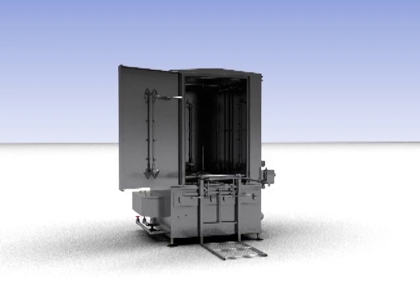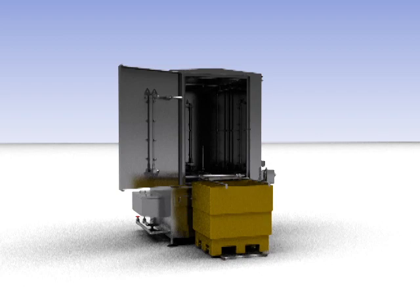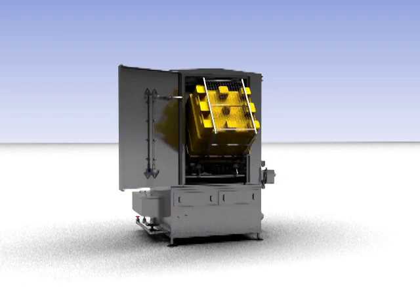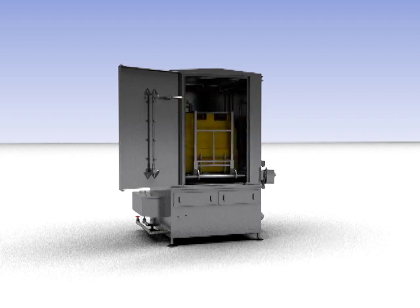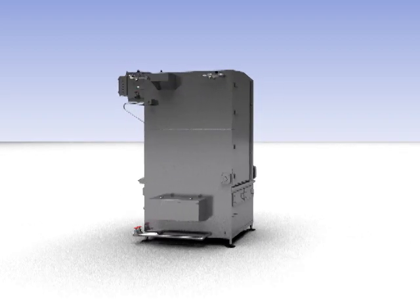Plastic or stainless steel containers are placed on the door or lift mechanism. A toggle switch or dual thumb switch activates the lift, which inverts the container inside the wash chamber at an angle greater than 90 degrees, or in some cases, like this particular model, 180 degrees. The start button initiates the cleaning cycle.